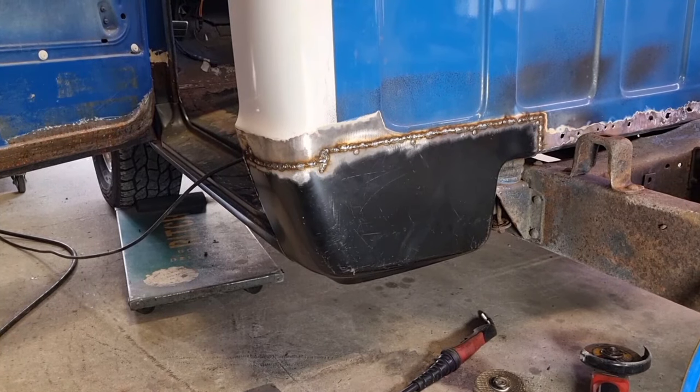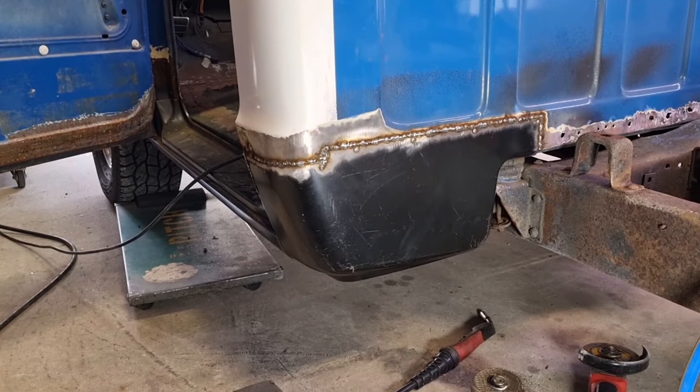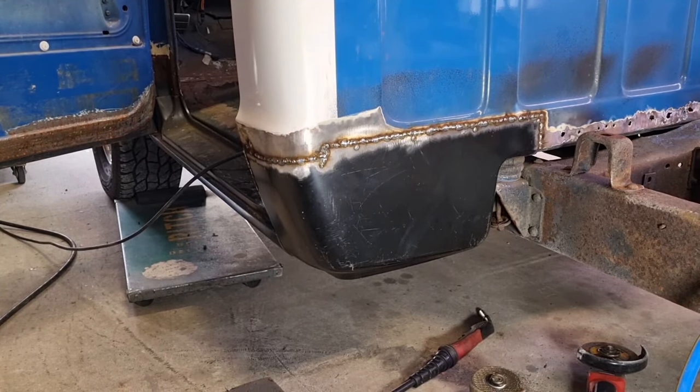I've done just about all of the welding. There's a couple of little spots there, which I'll come back to, but I'm just gonna go through with a grinding wheel on my 100mm grinder, my 4-inch grinder, and just aggressively take the top of it off. And I'm using that because I wanna do it quickly without creating too much heat. People often overlook the fact that grinding generates a lot of heat and that can create distortion. So I'm just gonna go through with that.